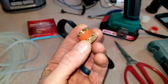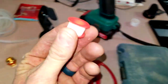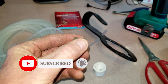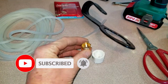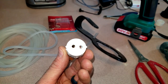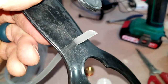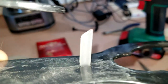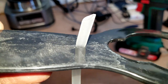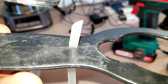That's what the reducer looks like. I'm going to put a little bit of Teflon tape around all male sections — right where my thumb is — then screw it into the cap. I've cut my tubing at a slight angle and it slips through the 3/16-inch hole really nice and tight, so there will be very little if any air escaping through the holes.